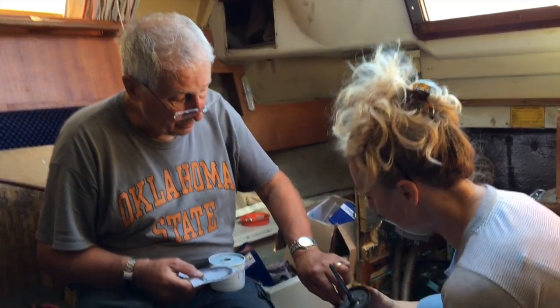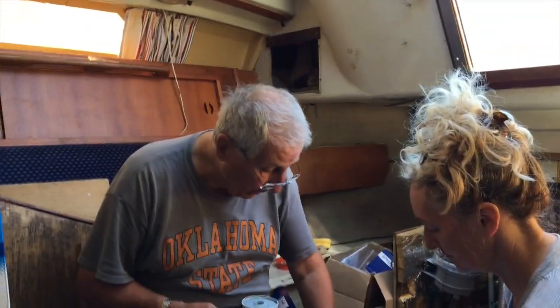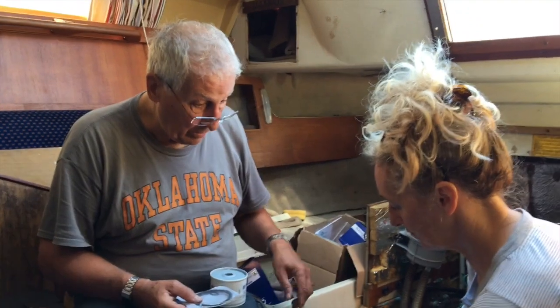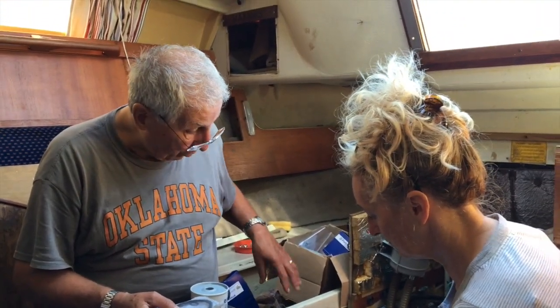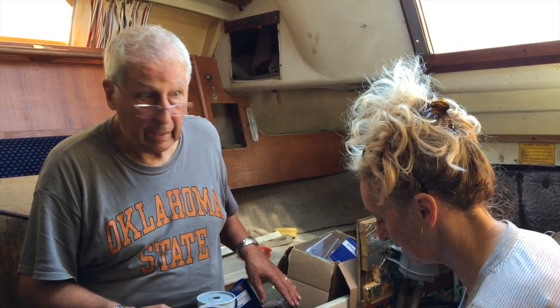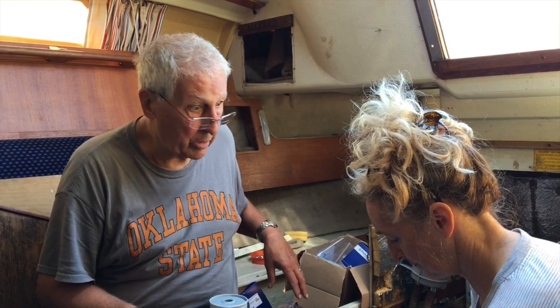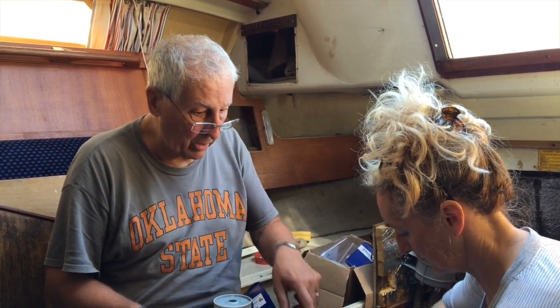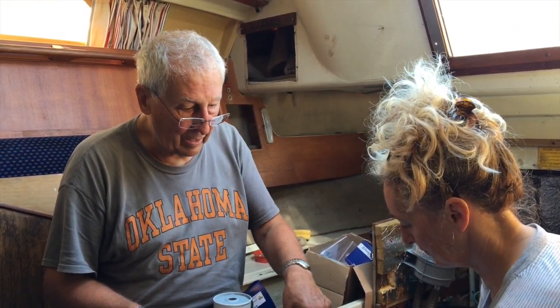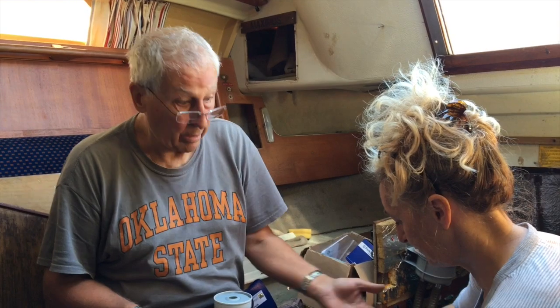So the primary fuel filters come out clean, which is a good sign. If it wasn't, what would that mean? It would mean that that fuel would have been dirty. What we know from taking the top off is that it's relatively clean, and that confirms what our initial diagnosis was. Yes, there's a bit in there, but it's clean, because if that stuff had been floating around whilst the engine was last running, I would expect to see water, dirt in there, and there isn't any.